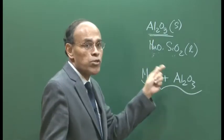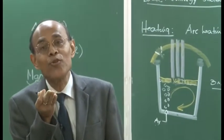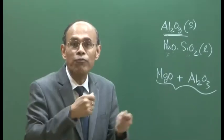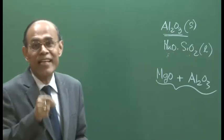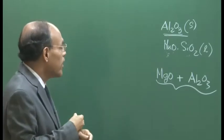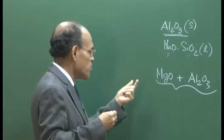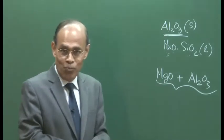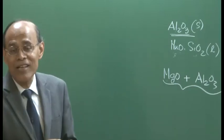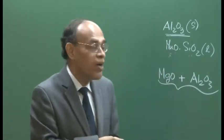Now, these inclusions, if they remain entrapped in steel, and you take a solidified steel sample and look at it under a microscope, then you should be able to see these foreign particles. Just like if you are making bread or chapati out of dough and you put some cumin seeds in it, the way you see those with your naked eyes is the same way you will see these. Of course, different shapes are possible, sometimes spherical, sometimes non-spherical, sometimes long strings. But you can see them under a microscope, because we are talking about 50, 60, 70 micron size particles, nothing above 100 micron size remains in the melt. So, in the solidified material, you can see these inclusions under a microscope,